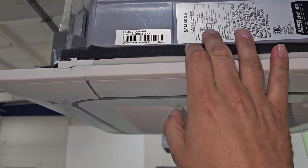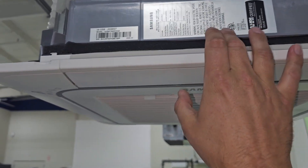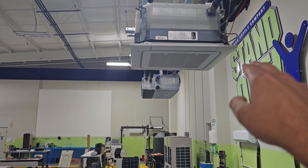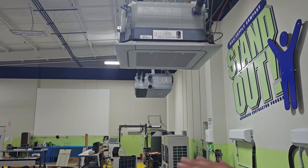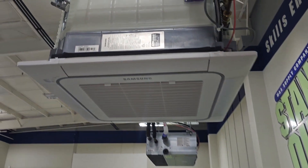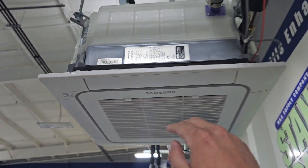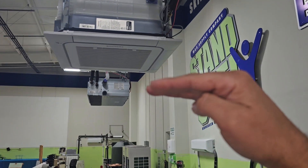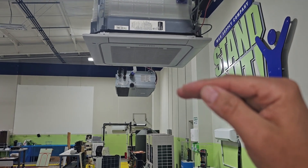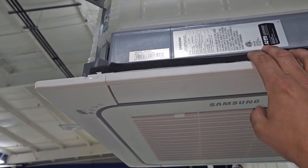This is the bottom of the four-way ceiling cassette, and it needs to mount flush with your ceiling. The reason it needs to mount flush with your ceiling — or the bottom of your sheetrock or trim — is because when you go to put the fascia panel on afterward and pull it up to the body of that four-way cassette, it won't be flush unless the bottom of the unit is flush with your ceiling.